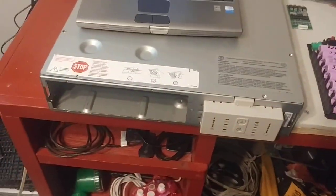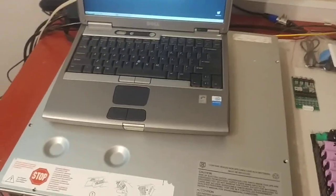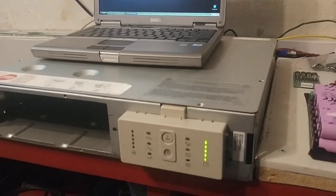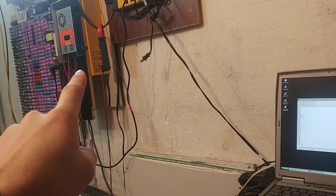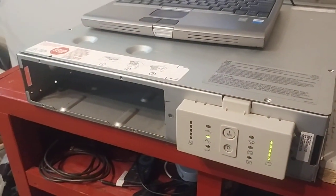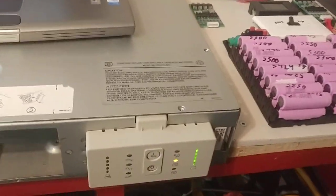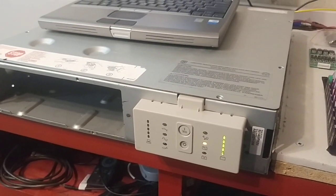So I'll plug it into my other inverter now — a Go Power Pure Sine Wave Inverter running those lights over there. No issues at all. Then I turn this off, and it right away switches over — now it's running off the battery, not running off the other inverter. No issues. So that's just another case for why it's worth it to spend a lot of money on a really good pure sine wave inverter. I just thought it was interesting, so I thought I'd share that. It's consuming a lot of power — just those three light bulbs are consuming 76 watts.